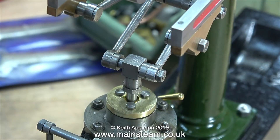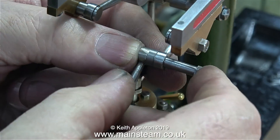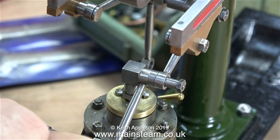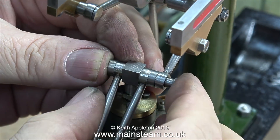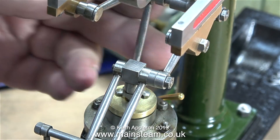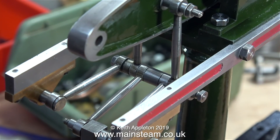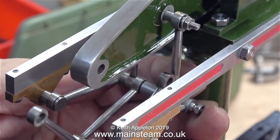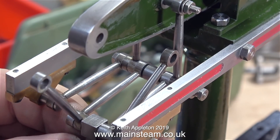In this clip I'm putting the Watt's parallel motion together wrong, just out of interest, to see whether it works — and it doesn't. If I put any spacers in at this point, what's going to happen is that as the piston rod goes up and down there's going to be a collision between the inner and outer pins. At this stage a schematic would be useful, because to be honest I'm starting to lose the plot.